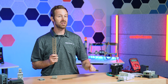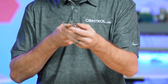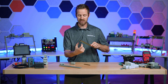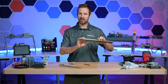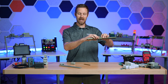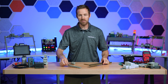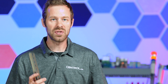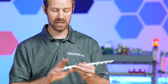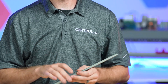Looking at the different sizes and styles of DIN rails, some have a wider profile, some are taller, some are smaller. And it's not just the DIN rails themselves — the mounting devices can be standoffs, directly screwed to the back plane inside a cabinet, or have angled connectors for standing up at an angle inside the cabinet. It's also about materials: steel is common because grounding adapters can connect the system earth ground throughout all components that must be grounded to the DIN rail and to the rest of the enclosure.